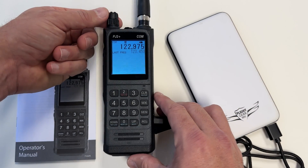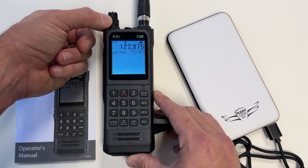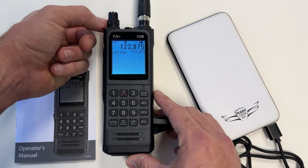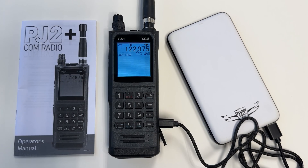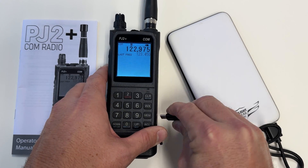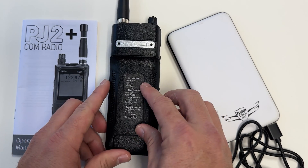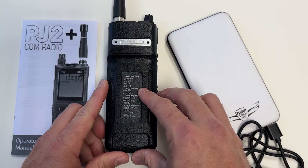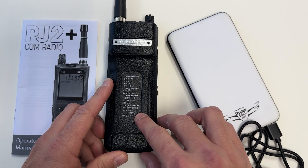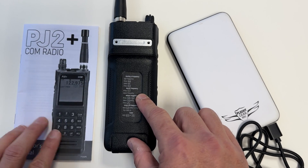A quick operational tip: when you turn the radio on, turn the volume up about halfway and then use the squelch knob to break squelch. Once you find that spot, just turn it a little bit beyond that to silence the squelch. These operations can be found inside the operator's manual. We've also designed a sticker for the back of the radio with simplified directions for storing, recalling, deleting, and erasing frequencies, and scanning. If this sticker is not on your radio, you should be able to find one inside your operator's manual.